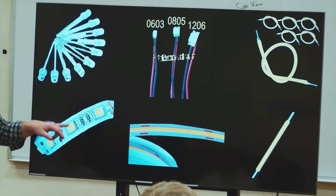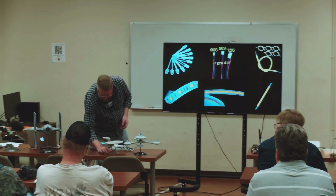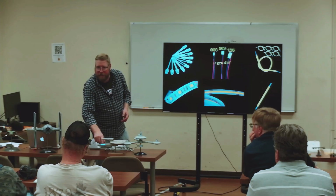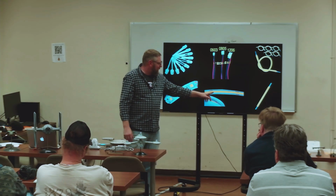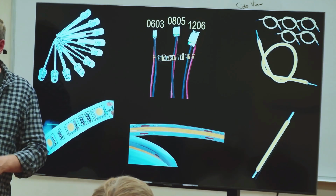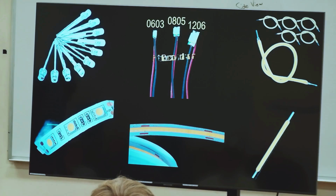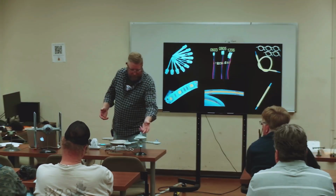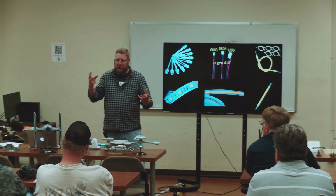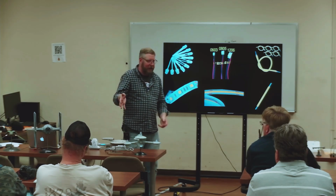The old LED tape, which is similar to that, it's just diodes on a strip, which is great for general lighting, but for example, it can leave hot spots, where the spacing is just too far apart, and that's where chip-on-board tape excels, because it's a ton more and they're close together, so it's a very, very consistent light, so then you get proper glow. Depending on what you're trying to achieve. If you're lighting a group of windows, it's not too much of an issue because of how light transmits, but in the case of Star Trek in particular, those warp engines are hard to get right.